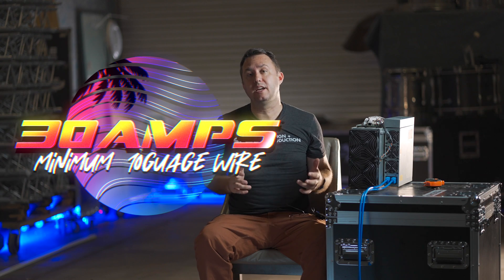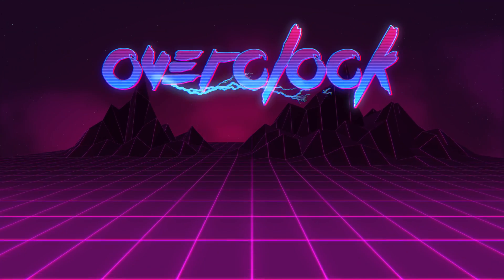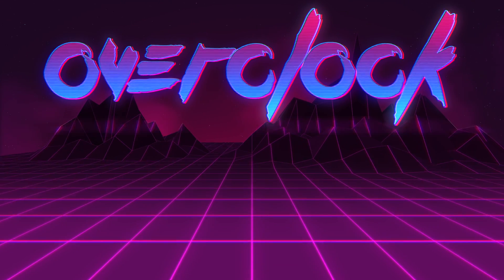So you're going to need to choose a heavy gauge wire. To pull 30 amps, you'll want a minimum of 10-gauge wire at 240 volts, but maybe take a look at 8-gauge just in case you want to overclock in the future. If you're planning to dip your toes into the wonderful world of overclocking, well then you need to reassess the size of everything.